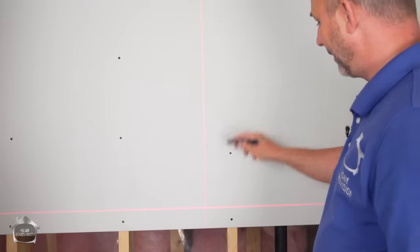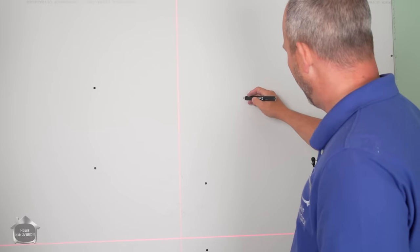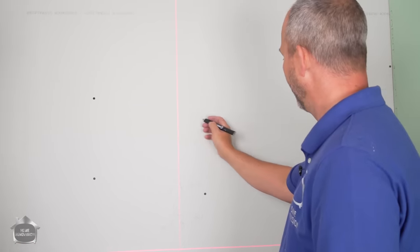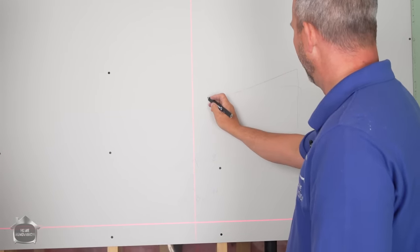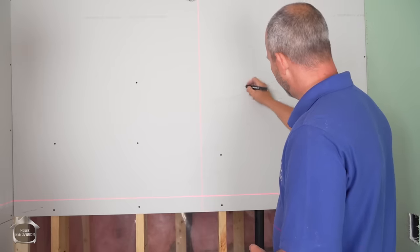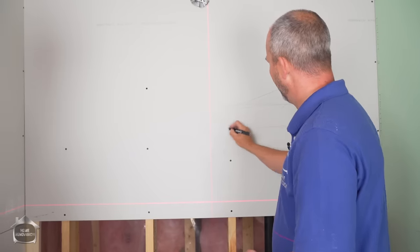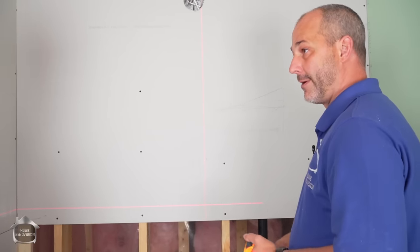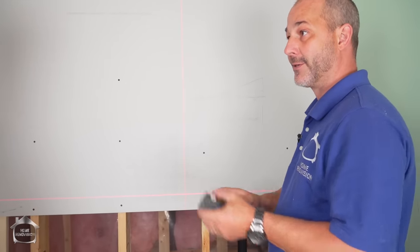Now, you take this information, so you take your slab and you're going to drop your center line on it, right? And then, although the slab is shaped like this, we're going to cut from this corner something as square as we can here, and then we're going to take the center line and translate all these pieces of information onto it, and we'll cut both ends to fit the room. Make sense? All right? Beautiful. All right. It's all you.